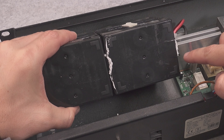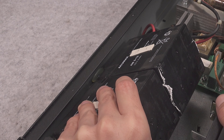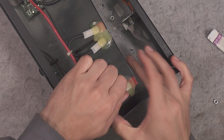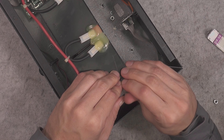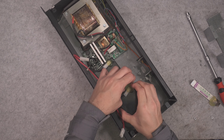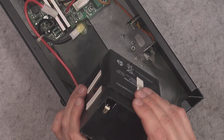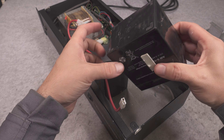We are going to replace them. This is a 24 volt system — we've got two 12 volt batteries in series. Most likely they are generic 5 amp hour each. We've got that metal bracket held by two screws. To get better reach I will use that contraption — we've got our extension — and now we should absolutely without any problem gain access.